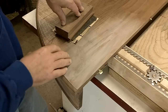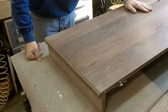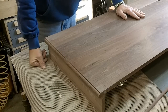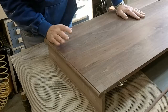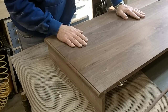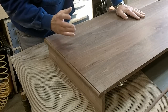I wanted to show you sanding it first. I was using the Crystalac product and I was hoping it would be a little less labor intensive than the Poro Pack, and I'm finding out it's just as labor intensive. It did a good job and I'm going to have to put a second coat on. The instructions were pretty ambiguous — they don't give very clear detail. It's just apply, wipe off, and then sand. What they don't tell you is you have to make sure it goes into the pores and get as much off as you possibly can, because if there are any sags or drips it turns into a plastic and it's very difficult to get off.